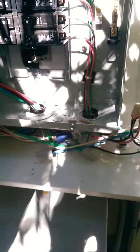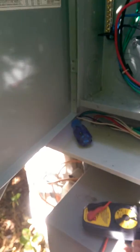You got it — together you get your 240, but not like you're thinking. I tried to put a whole-house surge protector — 240/120 — on it, and it didn't work. It burned up right away. I thought this was maybe a transformer issue, so I replaced it, and the same thing happened.